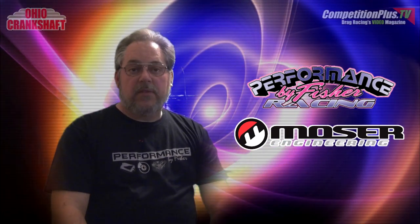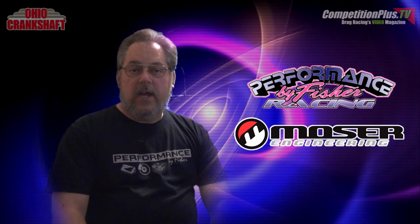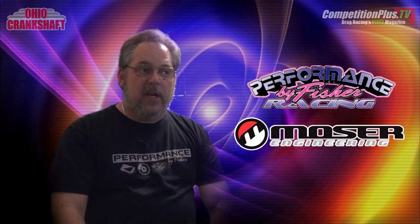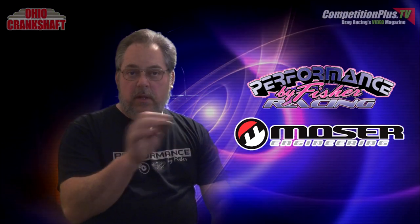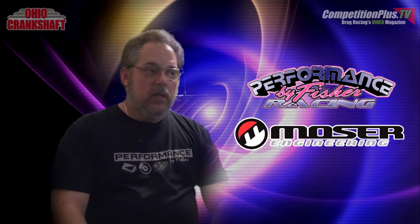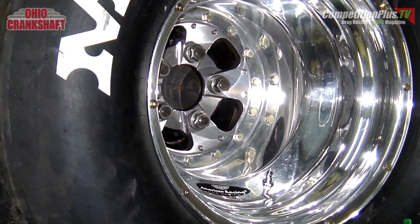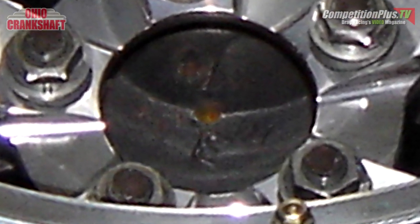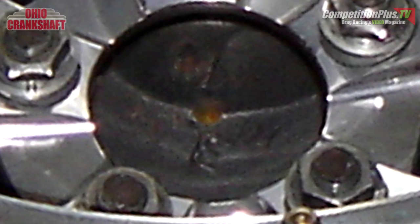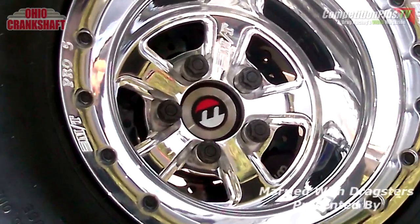When we upgraded Kathy's old car, one of the things I wanted to change out was the old axles. I mean, there were 35 spline, 13-year-old axles, and they still had the welded M/E on them, which was the signature of a Moser axle back then. And even though they were still in fine working condition, we wanted to upgrade like we did with my 09 car and go to a 5-on-5 bolt pattern, star flanged, gun drilled 40 spline axles.